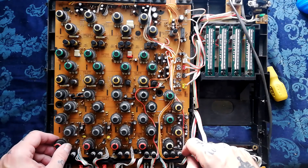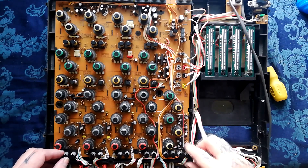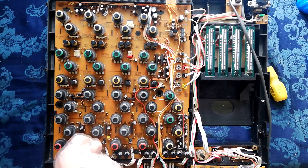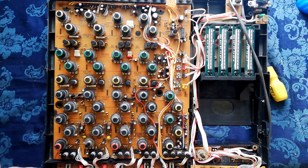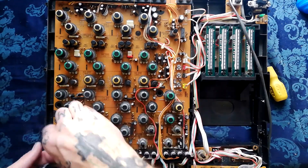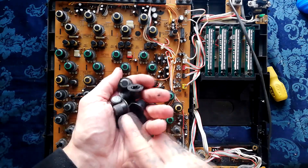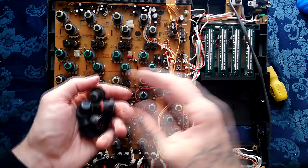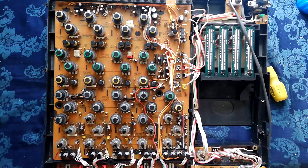Moving on to making this mixer ready for cleaning. You can probably leave the caps for these push buttons on, but in order to get at the shaft around here - sometimes if that's dirty it can cause crackling - so we need to take these knobs off. We'll just pull off from the front. I have a video about cleaning four-tracks; basically I'm going to be spraying with some Windex, a light brush and a rinse, drying them before they go back on.